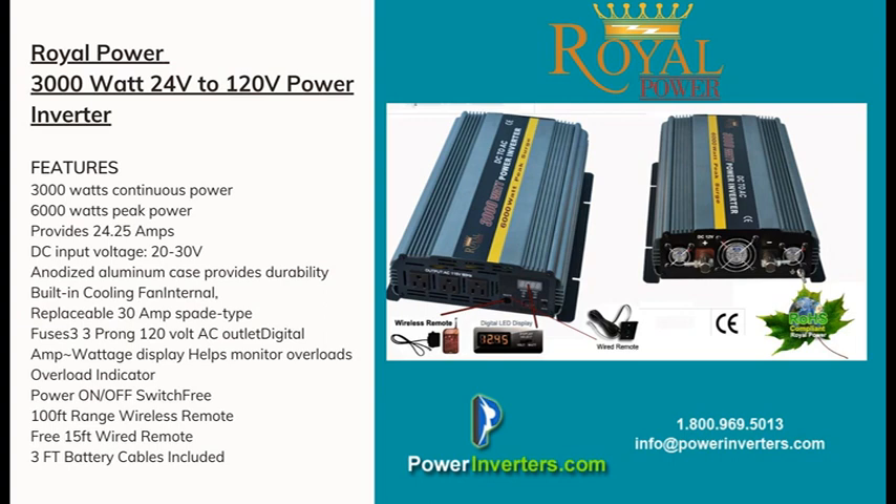For example, if your batteries are around 10 to 15 feet away and your cabling is too thin, you might get a false reading causing the inverter to go into a low voltage shutdown, even if you technically have a high enough voltage in the battery bank. Understanding that situation is important.